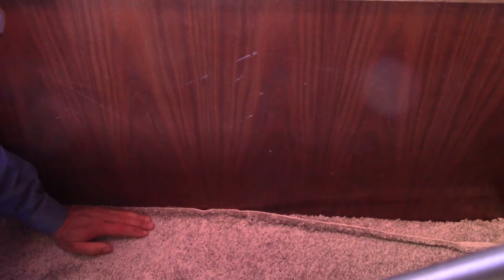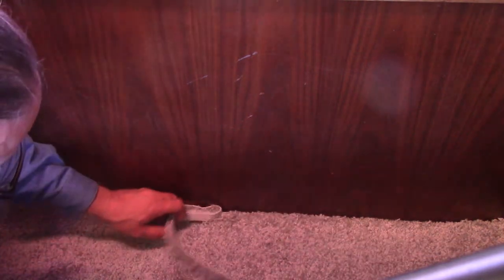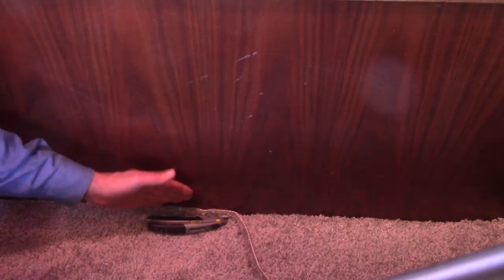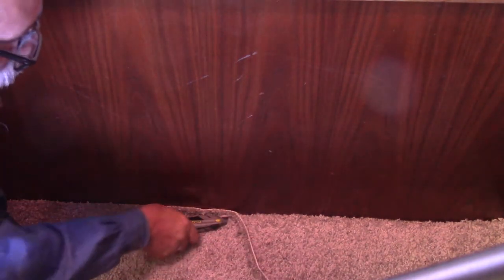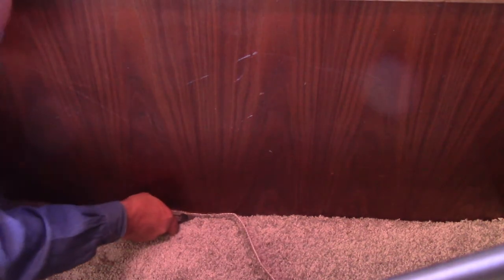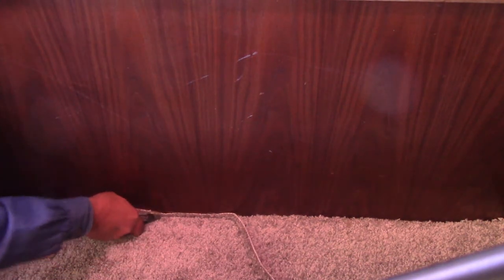Now I'm trimming along the wall here, really trying not to cut into the wall. I've kind of folded it back toward myself — it gives me a good idea of how far to cut. I want to cut it right the first time, because if you don't, you'll spend a whole bunch more time monkeying around. I'm coming in at about a 45-degree angle between the wall and the floor and shoving it right down as I pull the blade in a sawing motion. If I pull that away — I'm right to the wall. It all hides. It looks great.